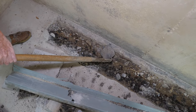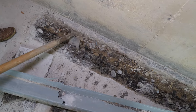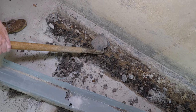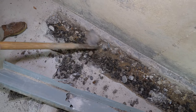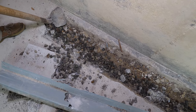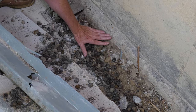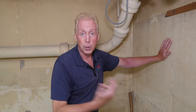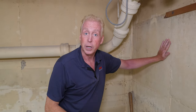There's no stone underneath it — it's not like the system was even properly installed. They put a little bit of stone on the outside but nothing at all underneath; it's down to just clay and the clay is all wet. This whole area has to be completely filled with water before anything can get into their drainage system. That's why these things fail all the time and we get called to tear them out and put real waterproofing systems in.